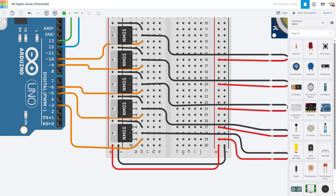Rather than repeating this for all five motors, we are just going to zoom in and look at the MOSFET connections for one motor. Tinkercad labels the pins when you hover over them with your mouse, so we can see that a MOSFET has three pins labeled gate, drain, and source. It is important to put each pin in its own row of the breadboard. A common mistake students make is to put a MOSFET with multiple pins in a breadboard such that all the holes in a row are connected, which would short all three pins together and your MOSFET will not work. Those pins need to be in different rows.